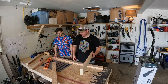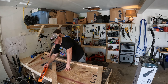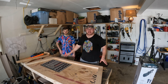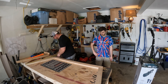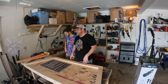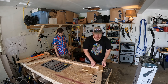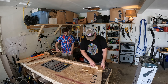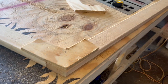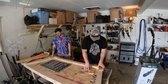So we figured out our basic design for our boat. It's gonna be about this size right here. This will be the very back of the boat, from the flat portion about 34 inches high. Everything is cut at a 15-degree angle — one of these on each side to work as brackets, so it'll hold it together like a bracket, and hopefully that works.